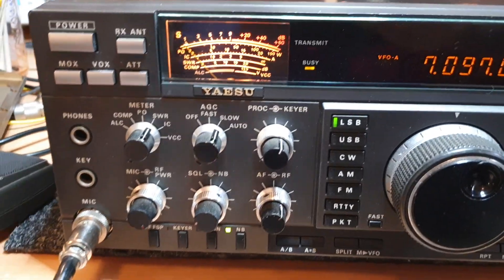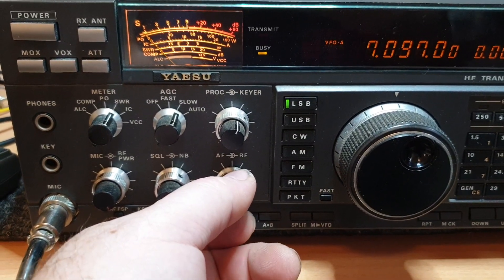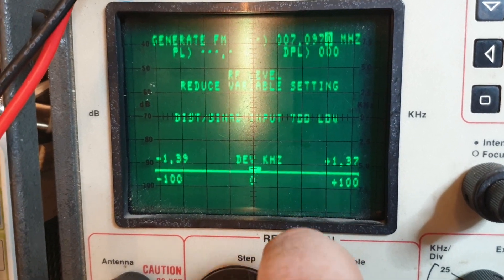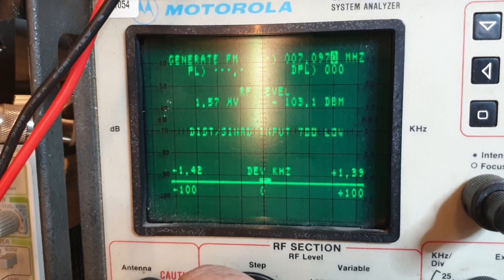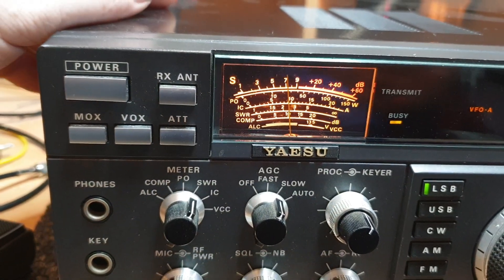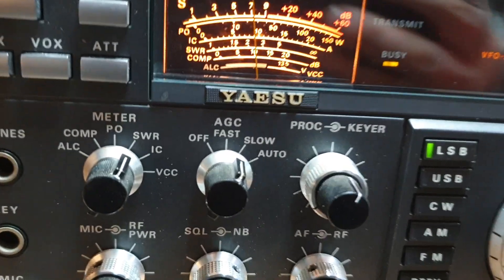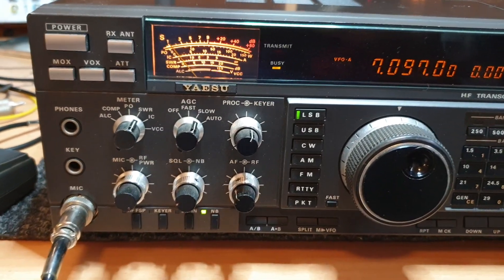I am still hearing that at 0.039 microvolts, which is minus 135 dBm. It's right in the distance. My goodness — that is a super hot receiver, I've got to say. And in our normal 0.5 microvolts, it's completely noise free. We're just under 50 microvolts at the moment, so we're not too far off. That gets rid of that noise. Superb receiver on this.